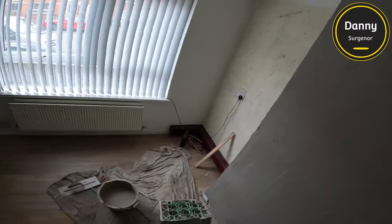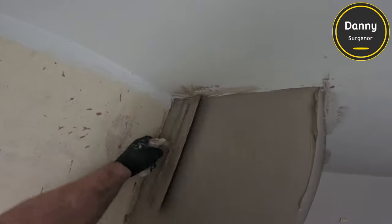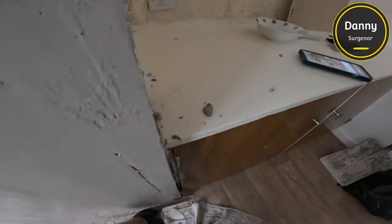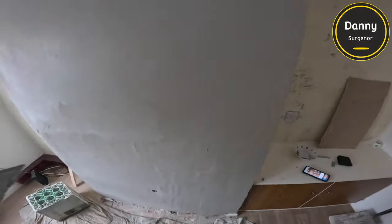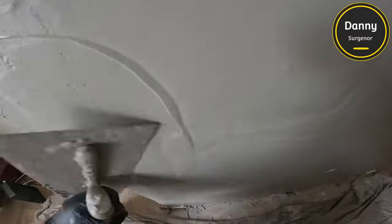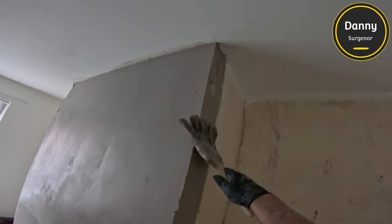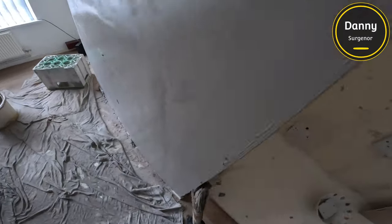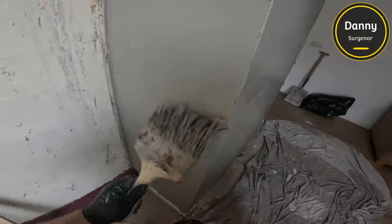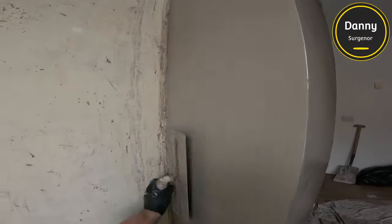You can see here I'm only closing the plaster in and the top of it is already looking good. You can see me slightly wetting the surface — you shouldn't really be doing that at this stage. I spend a bit of extra time getting it as straight as possible, trowelling both ways, and standing off to the side checking down the angle to make sure it looks straight.